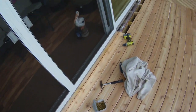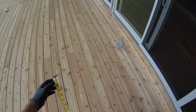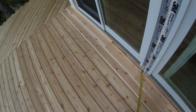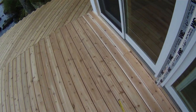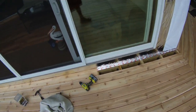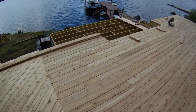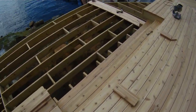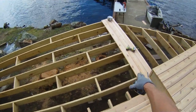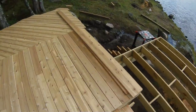That's my finished board, so now it all comes together. If you weren't vinyl siding, I would say put some sort of board to hide your rough edges against the house — cut one of these boards down and put it against here, a little molding piece, anything just to hide that and clean up your corners. Let's get this last one finished — that'll be the front part of this deck, then we need the lower portion and a couple stairs. It's coming along nice, and we have all different directions, as you can see. Keep switching it up and it's going to look real neat when it's all finished and stained.